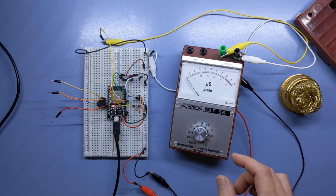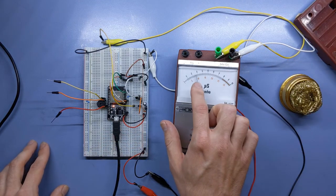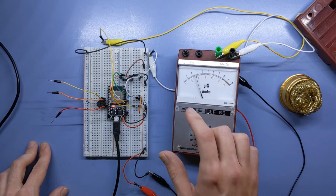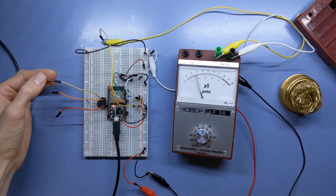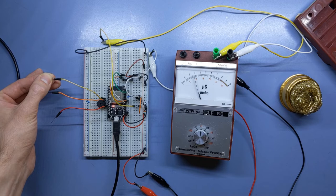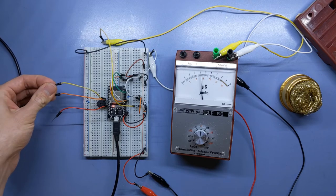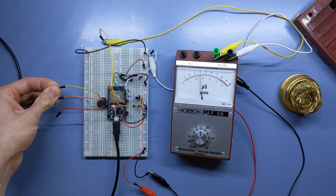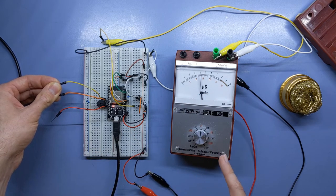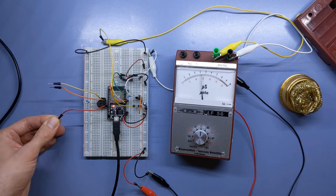And of course, we have our background value, which is now, it's all of course still a bit loose, reading 9 times 10 to the power of minus 1, so 0.9, which is way closer than the previous 12. So when I touch yellow for binary 1, the meter goes to about 9, 2 goes to about 11, 3 goes to about 13, 14. When you see the needle moving without me changing the inputs, that's part measuring inconsistencies and part randomness that has been added. 4 goes to 16,